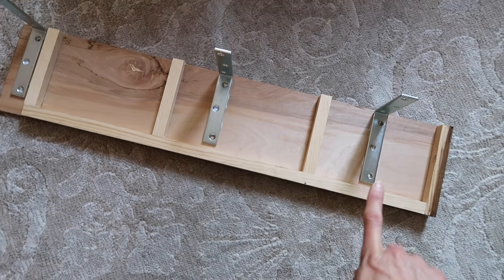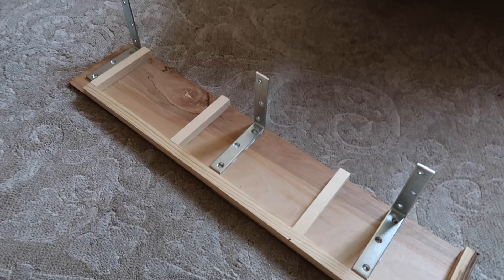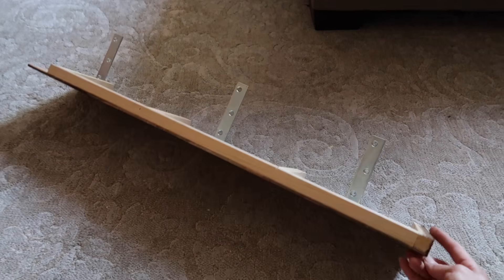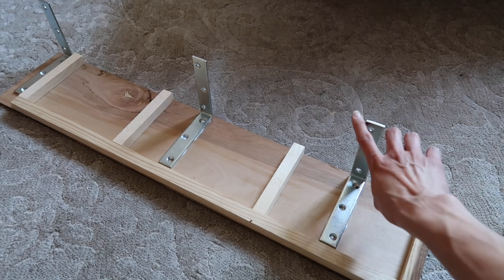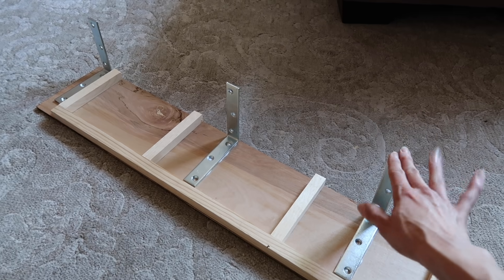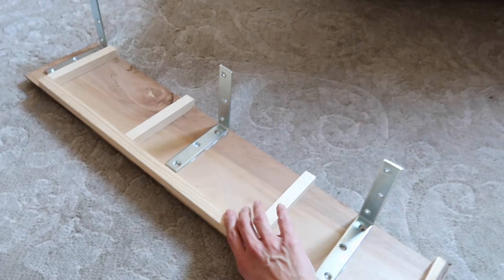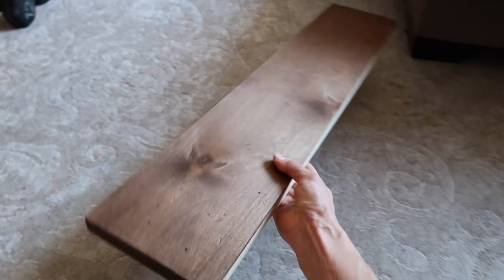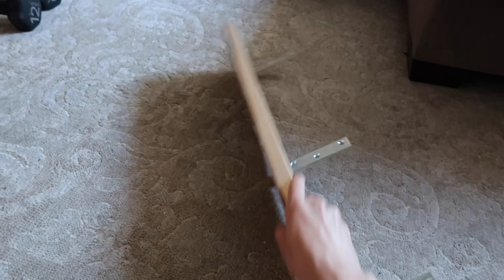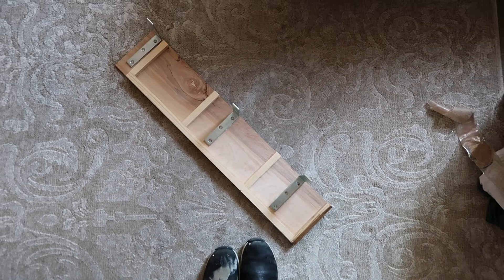This laundry room closet is very deep and my mom is very little so she can't really reach back. I decided to DIY some side shelving — basically a blend of the floating shelf and the bracket shelf. The reason I added brackets rather than fully building it like above the washer and dryer is because if they get a new washer and dryer that's slightly wider, they can easily remove the brackets from the wall without having to destroy the whole floating shelf and frame.